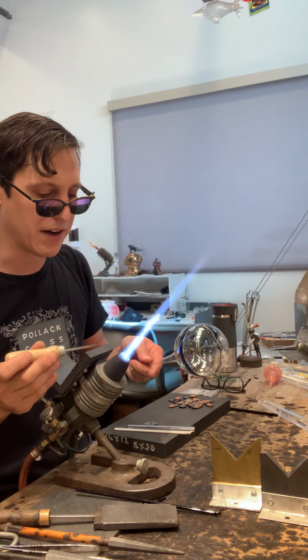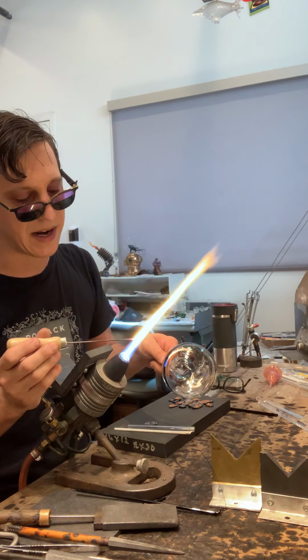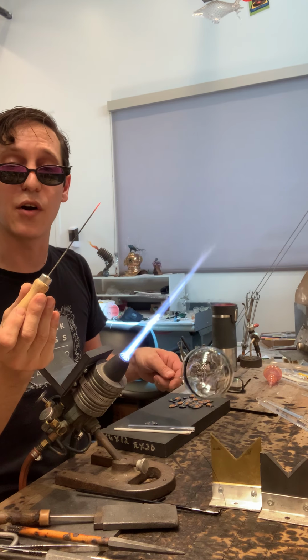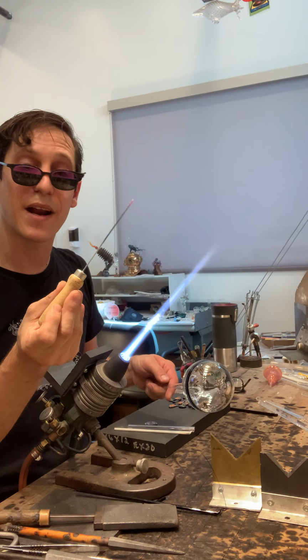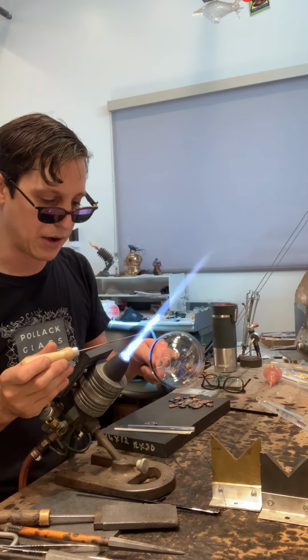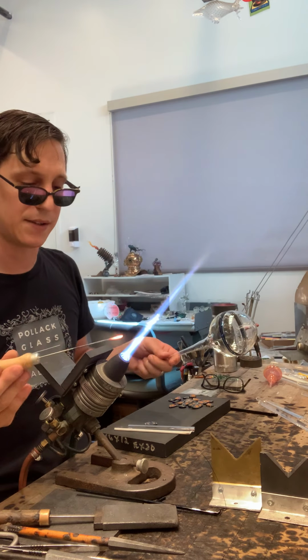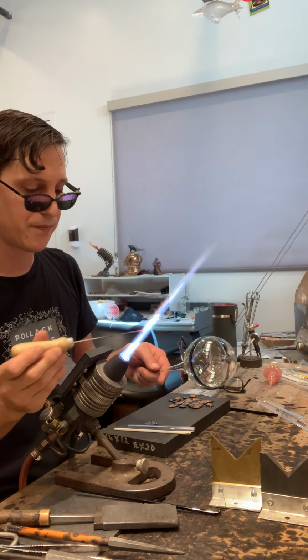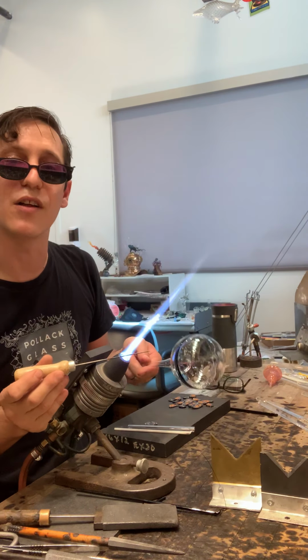I do it different every year. I make a different ornament, and they always have different rules depending on what you're making. But get your tungsten hot till it's glowing. See how it stays hot for a minute when you come out of the flame? That's your working window. Because if you're in the flame, you're going to be fuming all over your piece. You can see the smoke. That's the tungsten vaporizing. It'll vaporize an ugly yellow onto your piece.